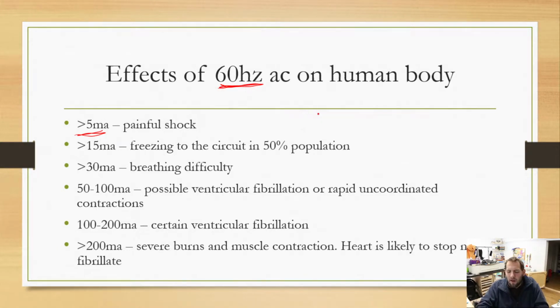Roughly, I believe it's 30 volts that is the magical, safe level to handle and deal with without too much worry when it comes to bare hands and skin and touching both sides of the voltage. Over that voltage, your skin doesn't quite have enough resistivity and you might actually start feeling shocks. But at greater than 5 milliamps, you get a painful shock.